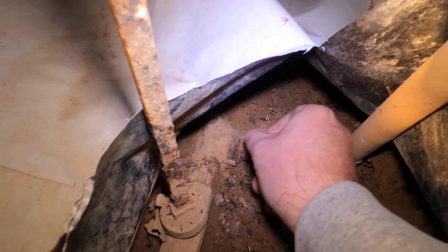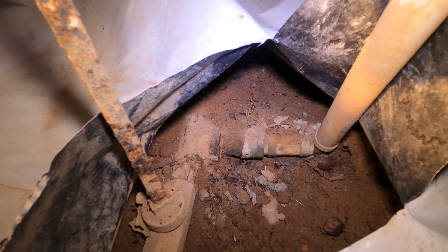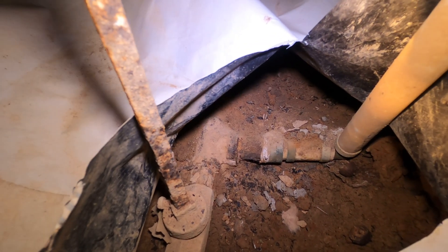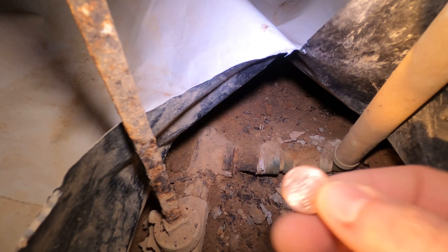As you can see here, nothing white is flaking off, and when I look down at the pipe, it's not shiny or silver. So the second thing they said to do was to take a magnet, and if it's magnetic, it's not lead. Now, if it were copper when I was scraping it, the scraped area would have looked copper like the penny.